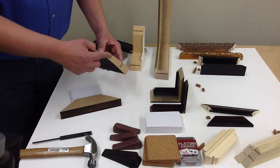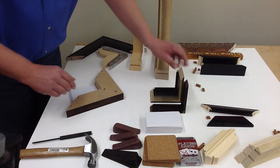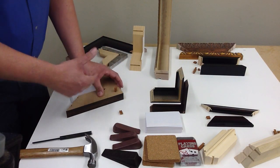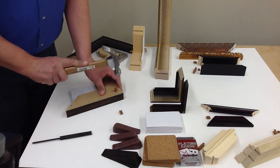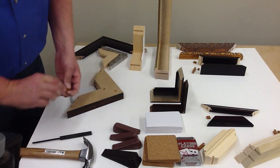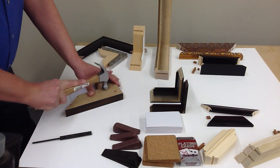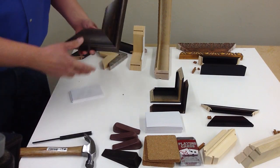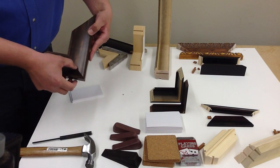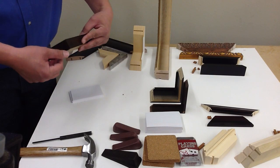So use the cards — set your molding on here, apply glue on both sides, slide it together, and insert the key in the thick, highest part of the molding first, then the second key on the inside. You will see how that joint pulls together all the way across — it is tight on the inside all the way down the outside corner.